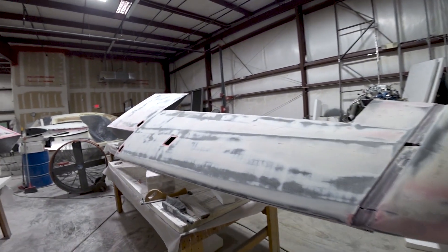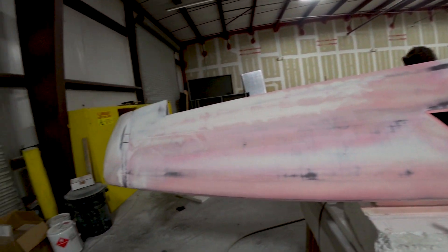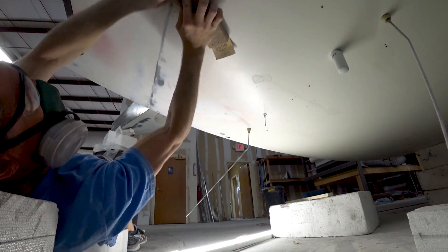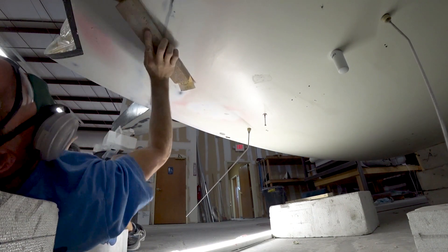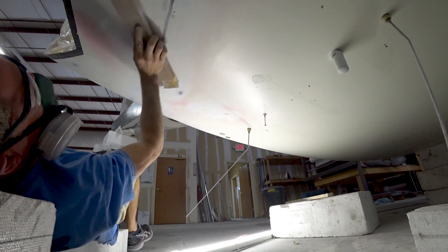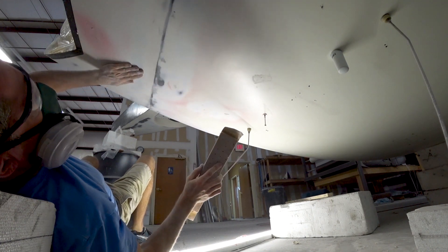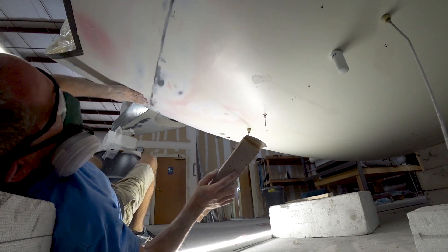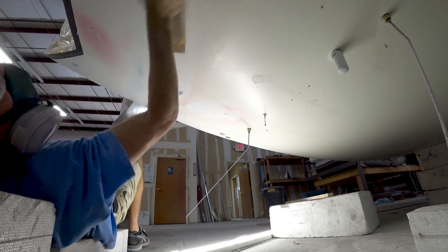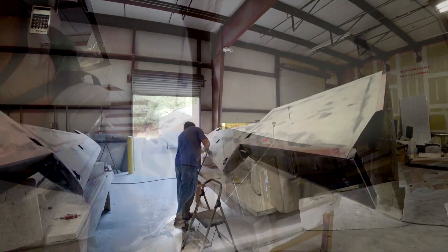You've seen these wings and you're going to keep seeing them until they're all done, but Jeff's been spending a lot of time getting those wings underway. Here I am sanding underneath — this is a join from the tail end of the fuselage out to the first part of the engine cowling, which is really the baggage compartment. This join is there purely because of a change in design: I was going to have one cowling extending all the way out, but we ended up splitting it into two and bonding the first section on, which made the engine compartment and engine mount point much stronger.